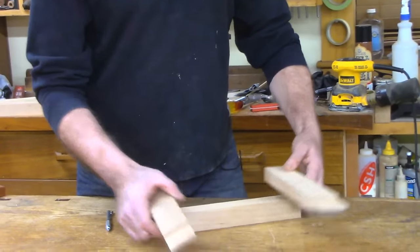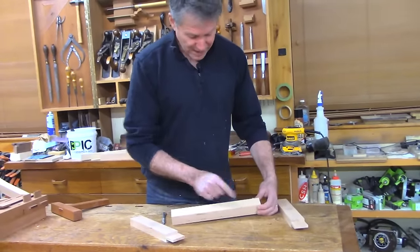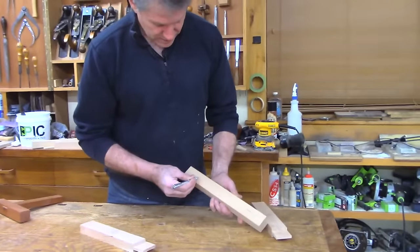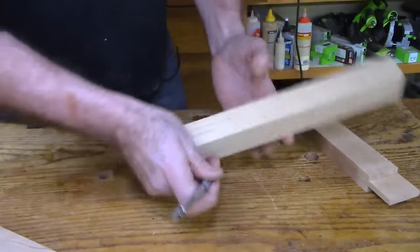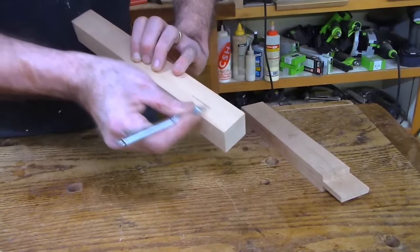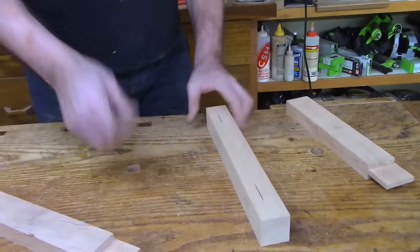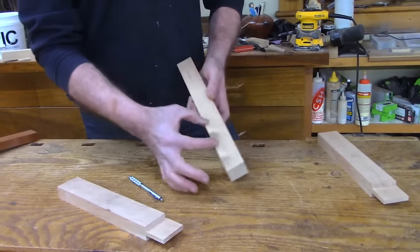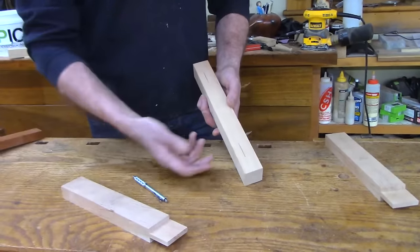So we're just going to mark those out. And I'm going to have it step in about a half, just before the halfway mark. So we're going to have a mortise here and one right about here. I'm just generally, so that means if I put my famous stop right there, my finger, I'm going to come over on this side and it'll be somewhere in this area. Let's see where this one is. Somewhere like right here. Okay, so that's where we want our mortises, and that's typical of laying out a project. You just roughly scribble where you want to make your dimensional indications for cutting them, whether you're doing them by hand, drill press, or with a hollow chisel mortiser.